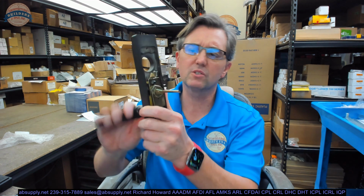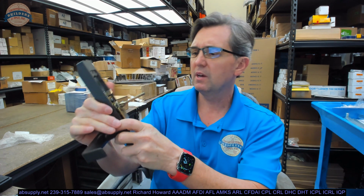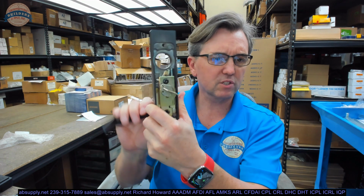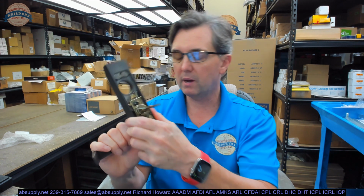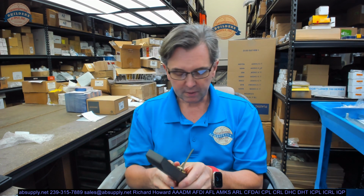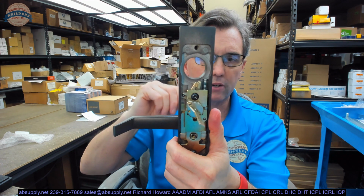Okay, and as I'm looking at this, I paused this video because as I'm operating, it becomes obvious to me that the tailpiece isn't turning. So we're going to have to discover the mystery as to why that's happening. What I'm trying to say is when this is unlocked, this tailpiece needs to rotate so that you can pull back the latch. We'll figure it out anyway. There's something to it. So, very simple. Mortise cylinder, a standard cam would be fine.